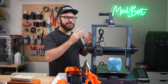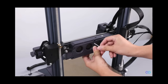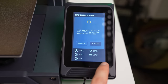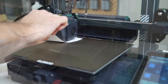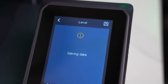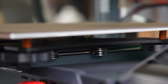The Neptune 4 Pro came packaged really nicely and the setup wasn't much different than any other mostly assembled 3D printer. In total, there were 20 screws to install, which is a few more than normal for similar form factor printers, primarily due to the toolhead and X extrusion fans needing to be mounted onto the printer's frame. Before printing, you need to go to the level menu where it will have you set the Z offset, do a manual level to get the bed as flat as possible, then it runs its massive 11 by 11 point bed mesh. The final step before printing is applying the included grease to the linear guides, as both the guides and wheels are metal.